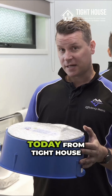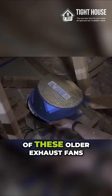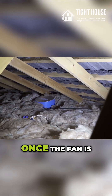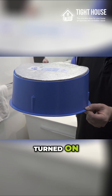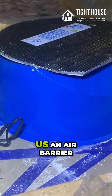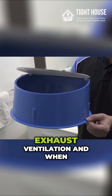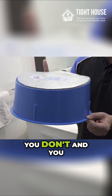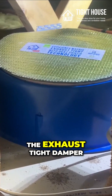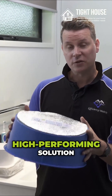These are the draft stoppers from Tite House that we're going to be using today, going over top of these older exhaust fans — retrofitting a damper. An exhaust damper works by: once the fan is turned on, it pushes the flap open. This gives us an air barrier that is flexible for when you need exhaust ventilation and when you don't and want a comfortable living space. Overall, the exhaust-type damper is a cost-effective and high-performing solution.